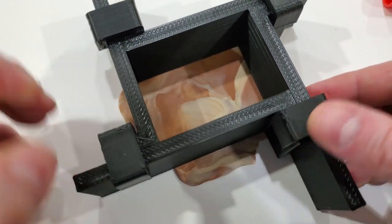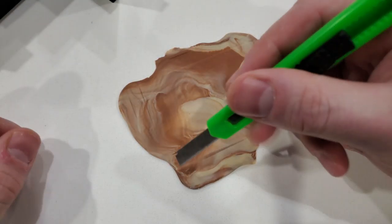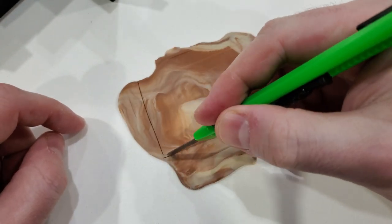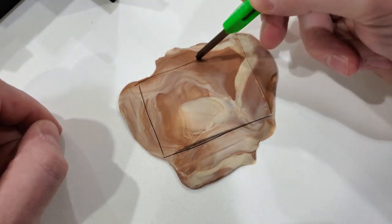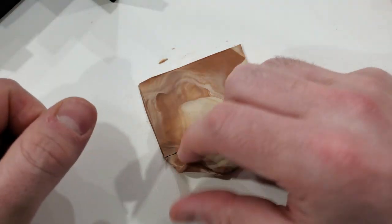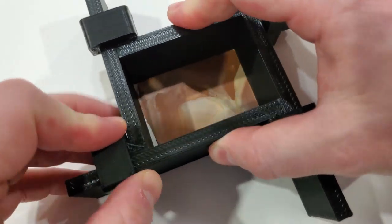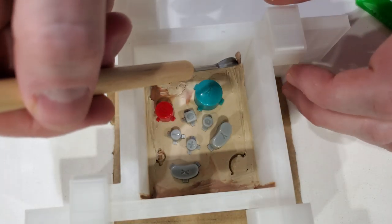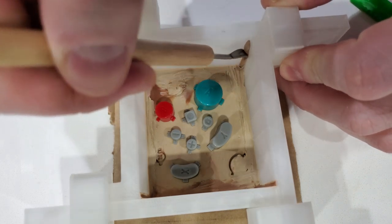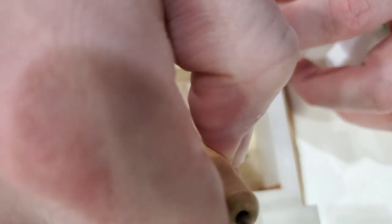When using plastilina clay it's a bit crazy but I use this little mini rolling pin — it actually came from my kids' Play-Doh set, yeah don't tell them please. I find that it flattens the clay very well. The goal is to have your base as flat as possible as it'll minimize future flashing. From there I simply cut the clay to size and arrange it within the mold box. Finally, prior to pouring silicone it's important to make sure all edges of the mold box are sealed — I simply use a little bit of plastilina clay to make sure it seals all the joints of the mold box including the sides.